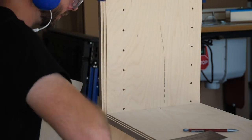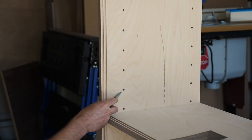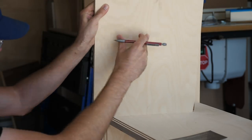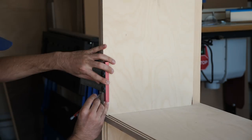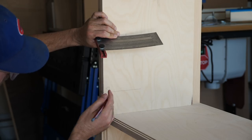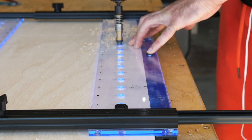By the following morning I'd assembled everything except for the top and the vertical partitions on top. The reason for that is I wanted to use the side pieces as a guide to tell me where to drill the shelf pins in the top partitions. I could have just calculated this, but it's more likely that I would have gotten off, so I decided to use the existing holes as a guide. Then I could finish off those holes and assemble the rest of the cabinet, including fitting the doors and attaching the back.